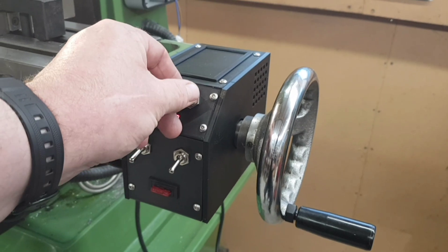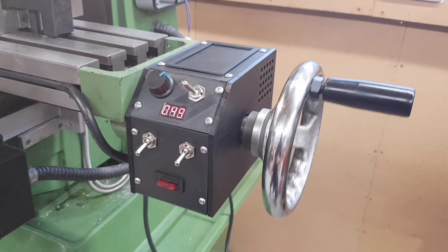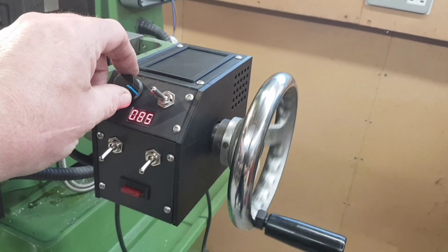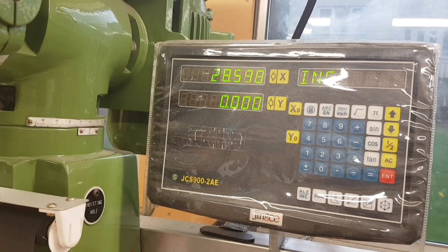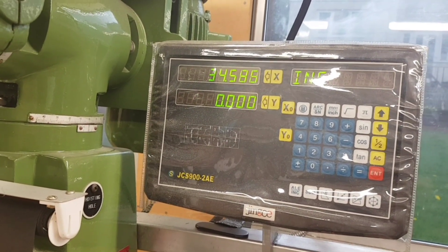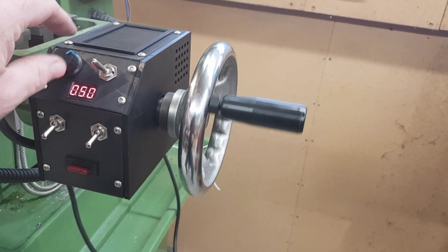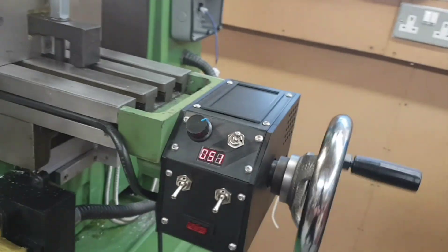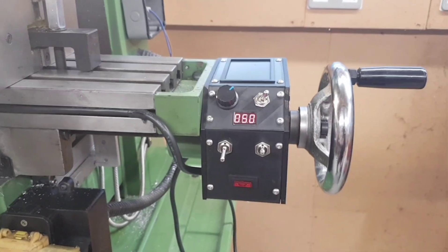You can see she's driving fine. Switching it off — the magnet is still engaged, which is something I need to sort out. Then back the opposite way. The motor is not sounding the best, but we have got speed control. Taking it up to 100 — on a one-to-one drive it's quite fast. Taking it back to about 50%, I think she'll go relatively slow, but I think I need a new motor to be perfectly honest. Stop it, take it back the opposite way. The advantage for this is I could probably set it as an emergency stop — that's the drive disconnected.